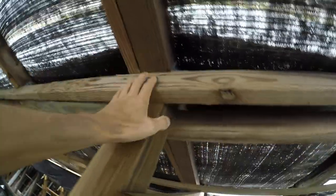It's attached all around. I mean, not only the rafter is attached with 1, 2, 3, 4 screws, it's also attached to the cross piece. Cross piece is attached to the pole as well, as you can see. And then the rafter is attached to the post on the other side. Okay, and then keeps running. This one is attached with 1, 2, 3, 4 screws on the bottom. Then the rafter keeps running and meets the 4x4 that continues the rafter. 4x4 is attached to this pole. Another 4x4 embedded in concrete, 3 feet. This one is attached with the angles and with the screws.